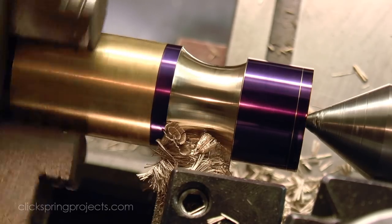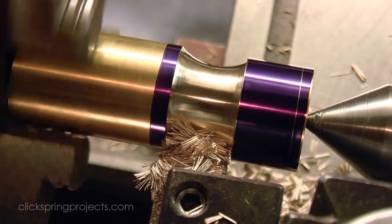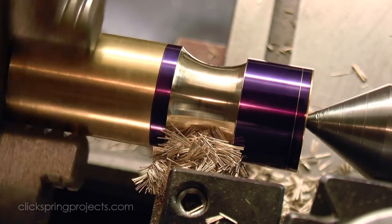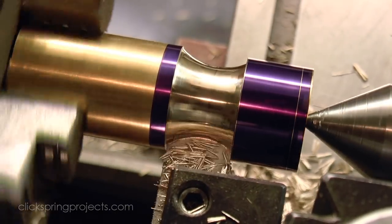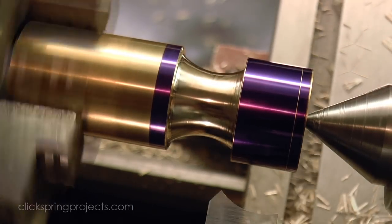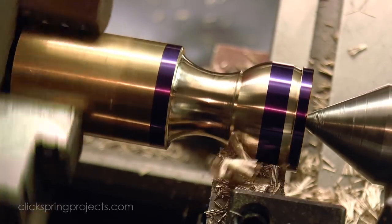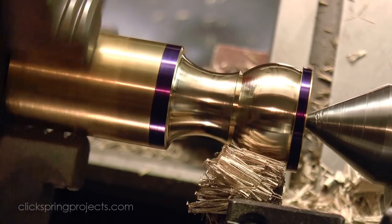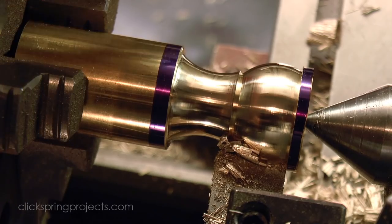One is to minimise the length of that cutting edge as the cut proceeds to depth, by moving the tool ever so slightly from side to side as the cut proceeds. This limits the cut to one side or the other of the tool, and so reduces the tendency for chatter. The final cut is then taken with the machine turned off by simply pulling the chuck through by hand.